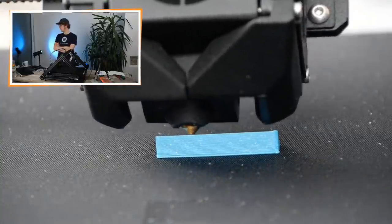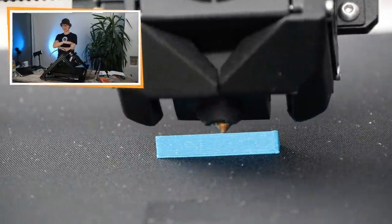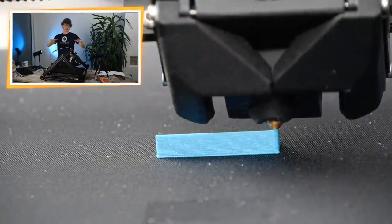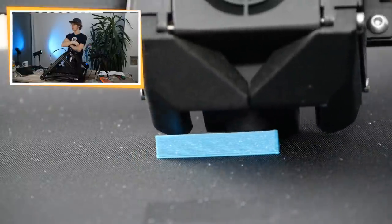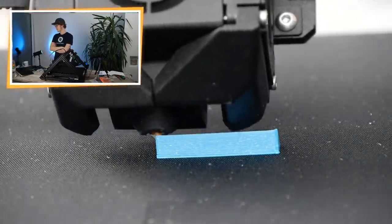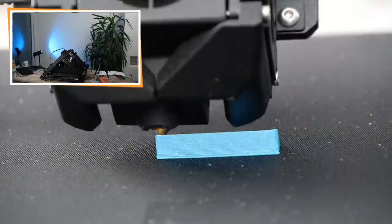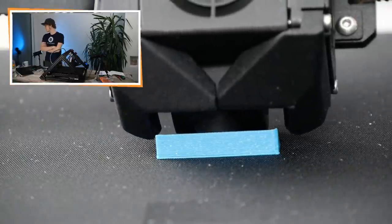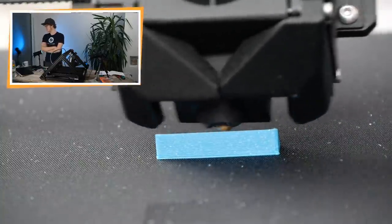There's a vacuum plate underneath the belt to keep it pulled down. I think the print platform itself is risen a little bit. It's a little bit higher than the level of the rollers. So this way the belt is always really nicely pressed against the heated bed. The right corner is strange, I think due to the fact that this is always the location where the layer starts and ends.